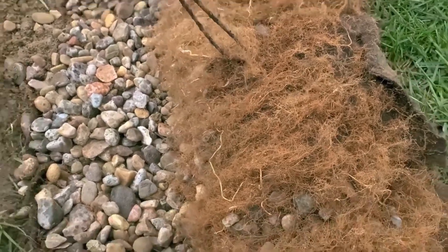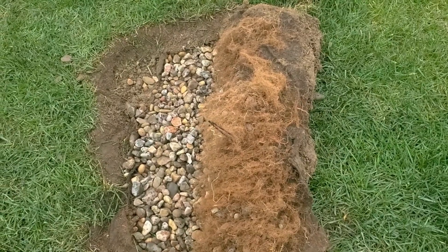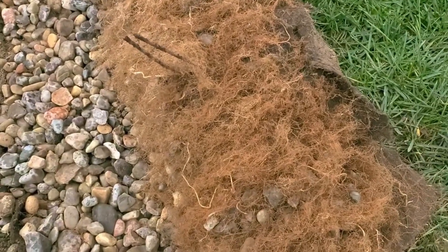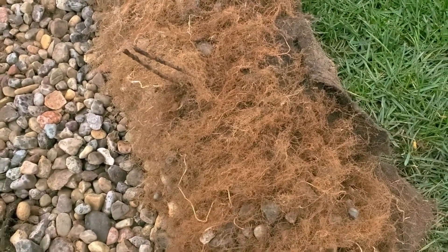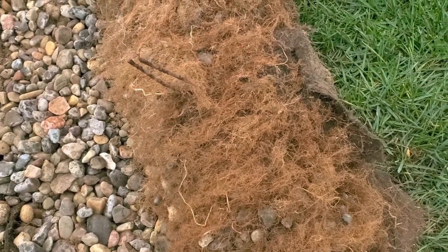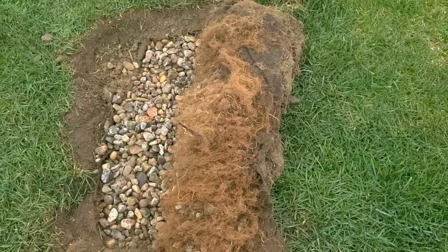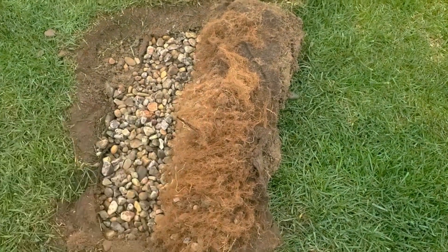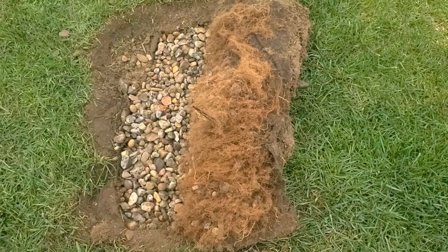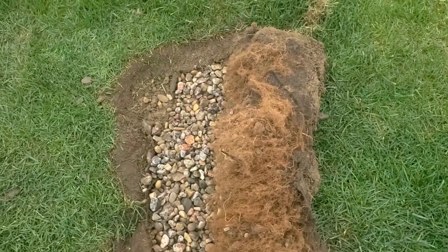This isn't magic, this isn't a mystery, but for some reason there are a lot of people out there that just don't want to believe in it. They'll throw mud on it and say, 'Look, water doesn't go through it.' We don't ever show a video of us throwing mud on our fabric. It's not a big deal if there's some dirt on it. We grow grass on our fabric, or we put more stone on top — the same stone that's underneath we'll put on top — and it's called an open French drain. I have many videos showing that technique. Both work great.